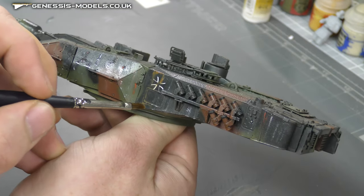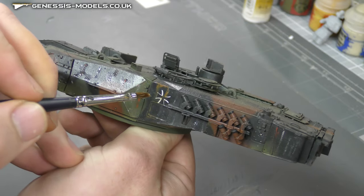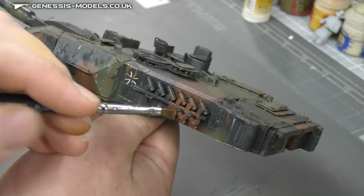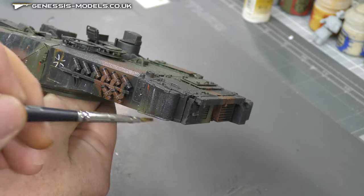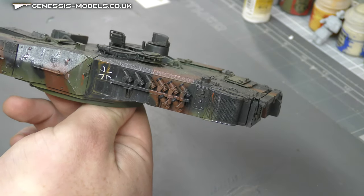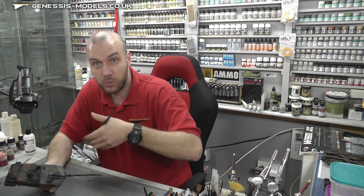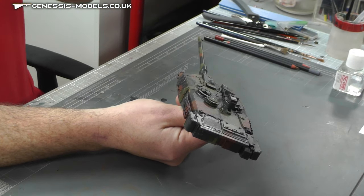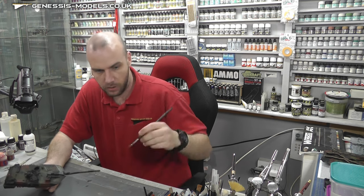We've got a bit of a pool up here so I'll just suck that up and clean the paint brush. It's not looking pretty at the moment, but the feathering process has started — it's thinning it down and blending it in. We'll come back over again, go all the way along, and start blending it so it's not such a hard streak. Then leave it to dry again for another five minutes.